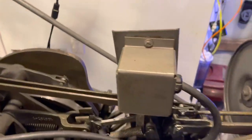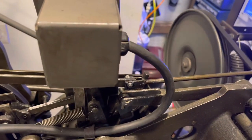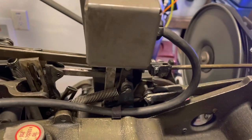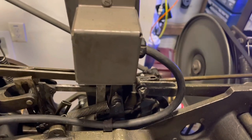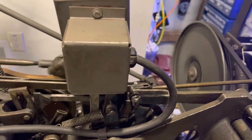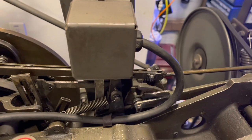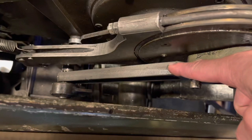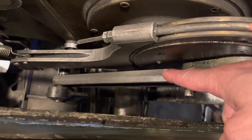You'll see the solenoid click and it'll release the clutch. That's the clutch arm going up and down. As long as that little arm stays out of the way, the other one can go up and down — right there it blocks it and stops the pin setter.